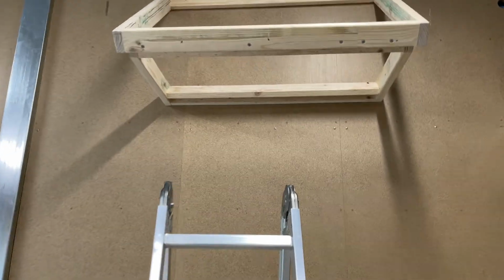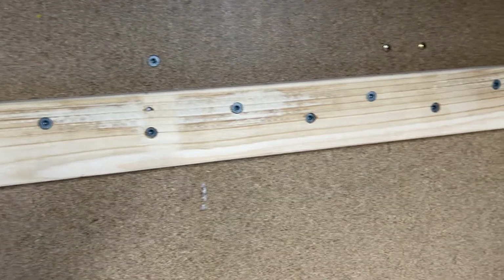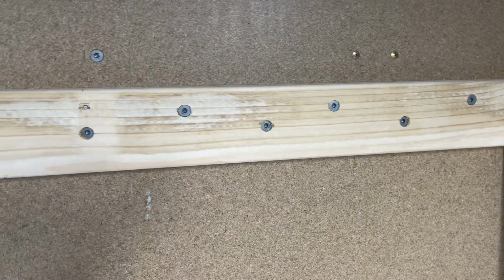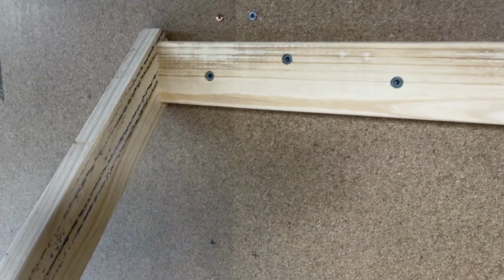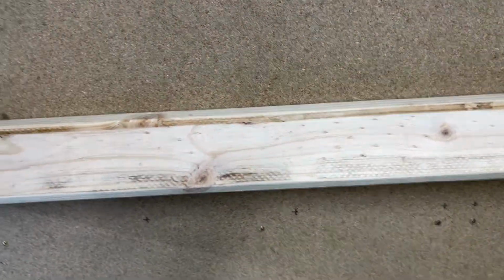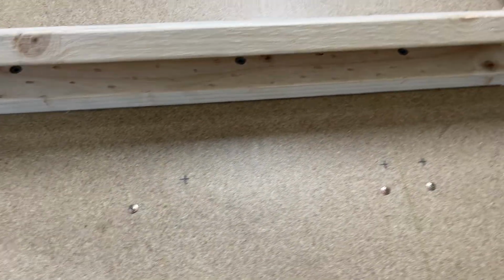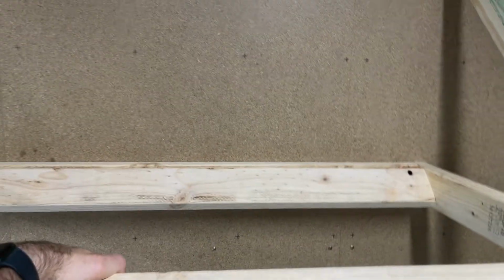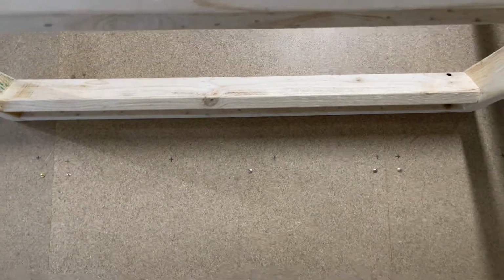Right, so I'll show you what I've done before I put the wheels on it. I've put a few Buildex screws in. The bottom row goes straight into the metal top hat behind, and the top row is straight into yellow tongue. I wanted to make sure I had secure fixing, because this is pretty much sitting on top of my four-wheel drive, so I didn't want it coming down. Then that bottom rail underneath, you'll see there's not much weight on there, but it's got 4 along that bottom row, and it's solid. It's got to take the wall down before it takes this down. So now I'll chuck the tyres up.